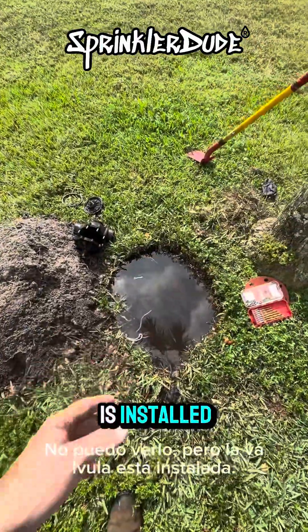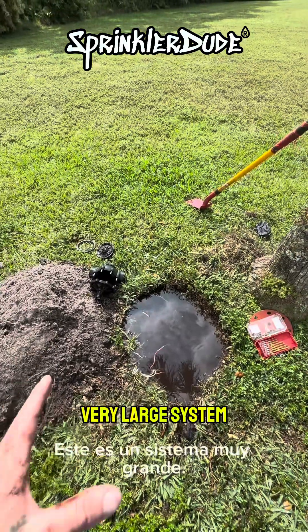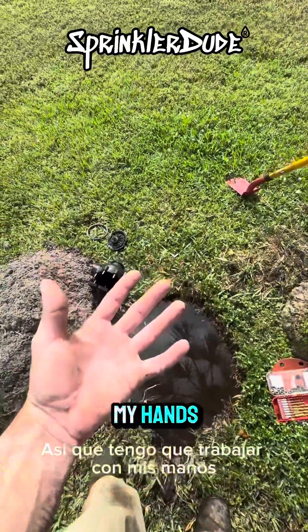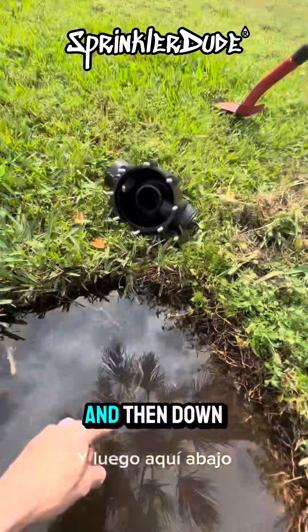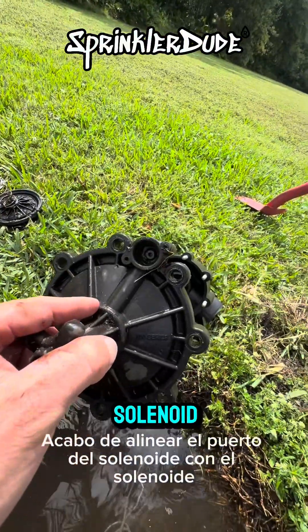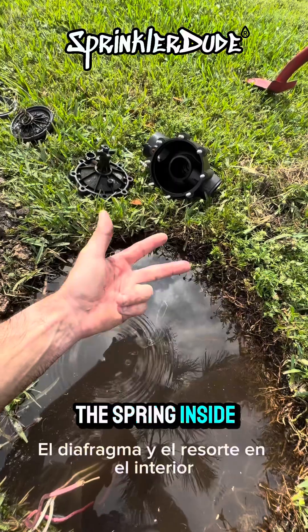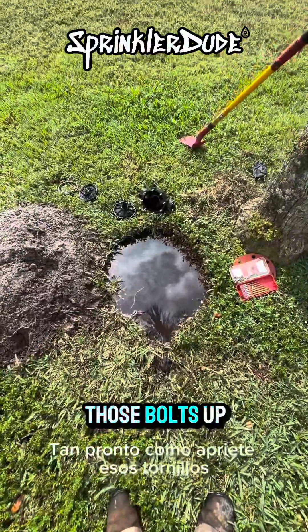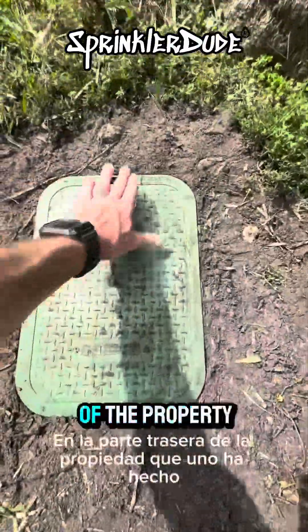The valve is installed. In this case I had two options: I could either wait for the water to drain out and have a dry hole to work in, but that would have taken several hours — this is a very large system. Instead I decided to work underwater. The water is dirty so I can't see, and I had to work with my hands. I set the other valve in front of me so I could see where the solenoid port was, then felt around until I found it and lined up the solenoid ports. As long as you have the collar, the diaphragm, and the spring inside you're good to go. Tighten it up, fire it up, and that valve is done.